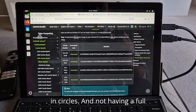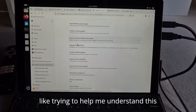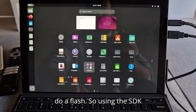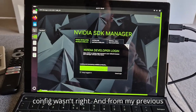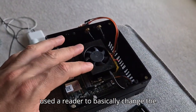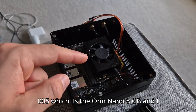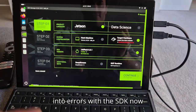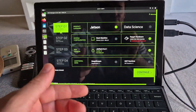I was really just going around in circles without a full understanding, just using ChatGPT. I essentially got to the point where I tried to do a flash using the SDK program from Nvidia — it would never work, kept getting CRC errors saying the config wasn't right. These two wires connect to the I2C bus connected to the EEPROM, where I used a reader to change the board identification from the Orin Nano 8 gigabyte SKU. I ran into errors with the SDK — it's too structured and tries to prevent you from forcing a flash onto the wrong target hardware.